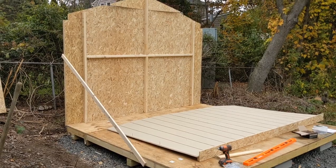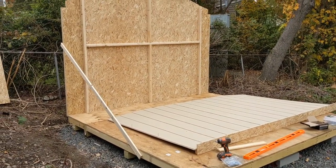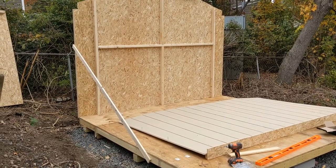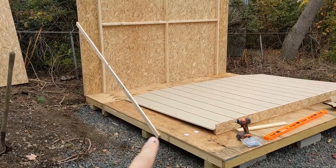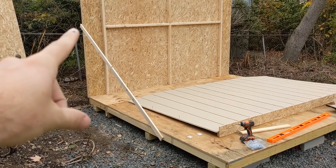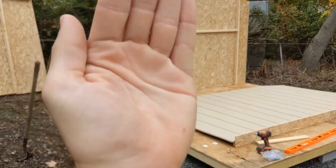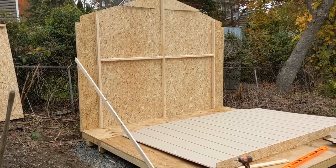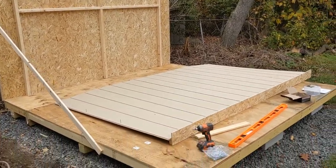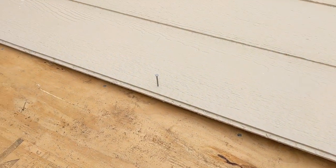This portion is not easy to do alone, but it is possible — I just did it. The key to doing it alone is preparing the brace ahead of time. Put in a screw down here on that part of the brace and make it so that it's strong up there. Even prep the screw there so that when you lift the wall into place, you can just grab that part of the wall and hold it while screwing it. A little tricky, but I'm going to try the same thing with this wall — lift it up alone. I've prepped the nails in place so that I can hold it with one hand and nail with the other.